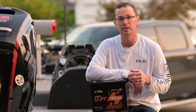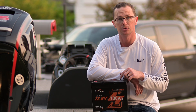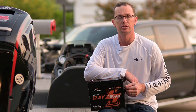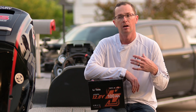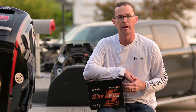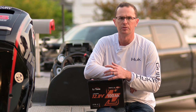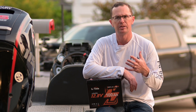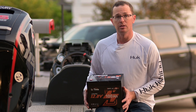As far as discharge rate, this battery has the upgraded BMS that's in the trolling motor battery, so it's upgraded for those high constant loads. It will take a continuous discharge rate of 100 amps, so any of the trolling motors you find are going to be supported by a battery like this. A lot of 36 volt or even 24 volt motors like an Ultrex will be in the 50 amp range, so you're well within the continuous discharge rate.